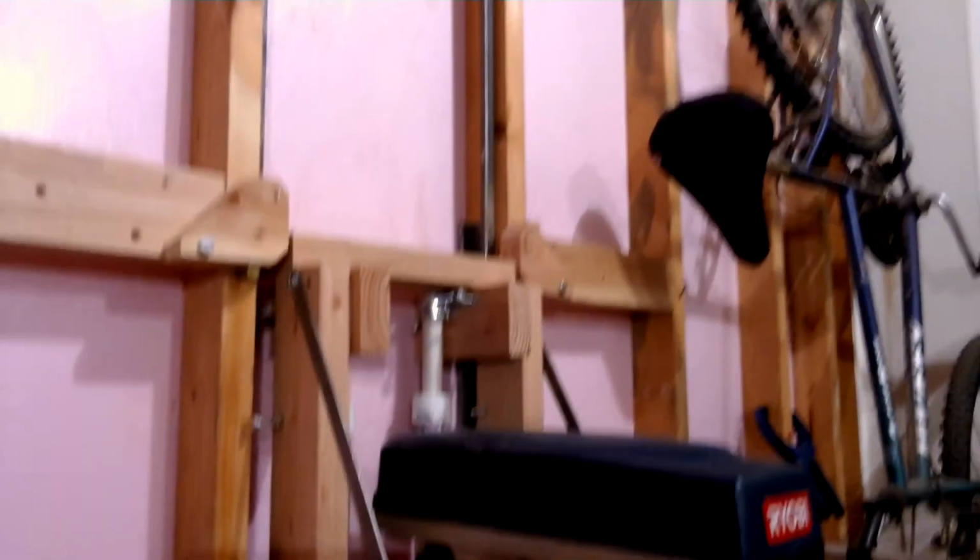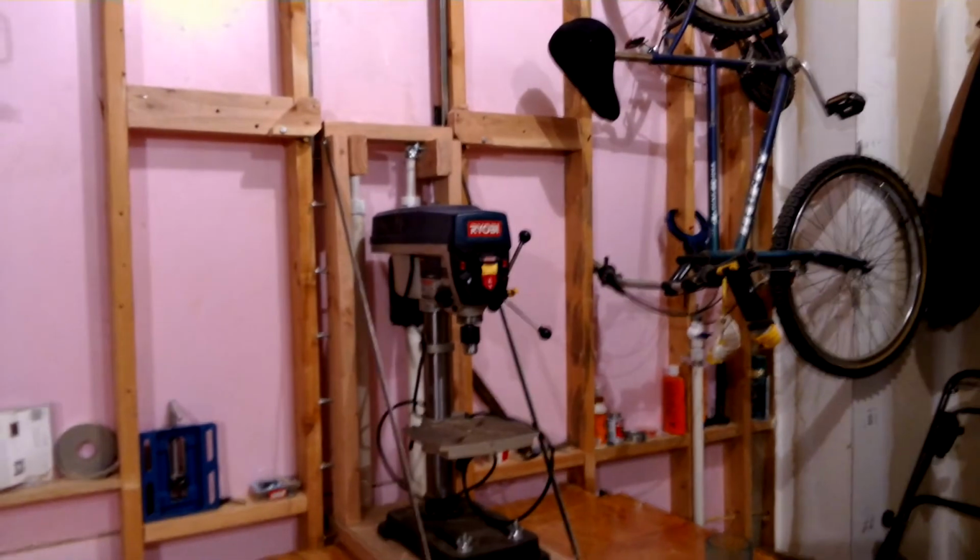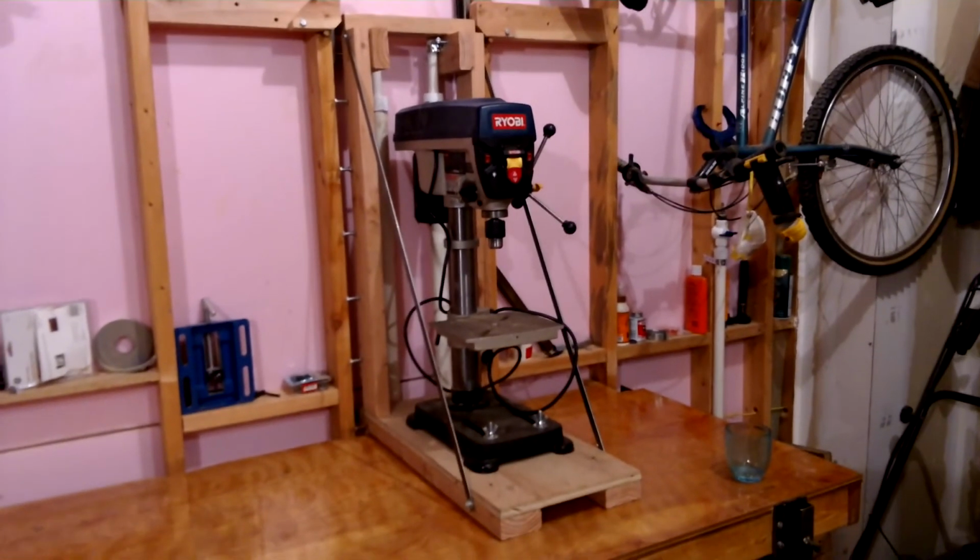And then I guess one other detail is the rails. I just kind of use the weight of the drill itself because it wants to make it fall forward, so it keeps the rollers. I got some garage door rollers and they nest up into the front rails there. The top ones do, as it wants to flip forward, and then some rollers in the back go up against the back rail in there. You can kind of see it push up against the actual wall of the garage. Anyway, that's how it worked. If you guys are interested, I'll let you know how it turned out.